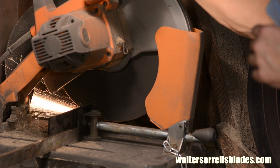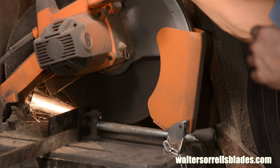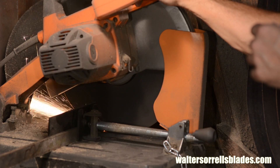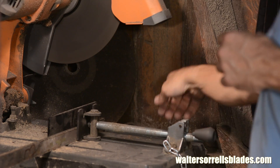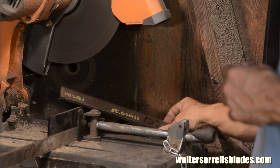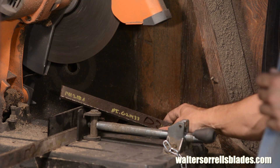The bad news is that it's not a laydown to heat treat this stuff, but there's a shortcut you can take on that front so don't despair. D2 is typically sold in what's known as precision ground form, meaning that it's ground very flat and to a precise and fairly fine surface. This makes it more expensive than steel that comes basically straight out of the mill, but on the other hand, when you buy it, it's already pretty close to being in a form that you can use without a lot of laborious flattening.